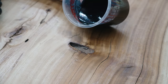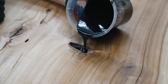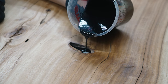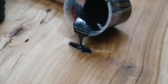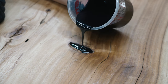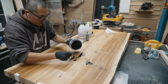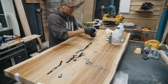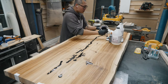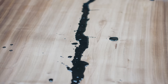The tabletop epoxy takes about 24 hours to dry and I ended up doing two pours because it shrinks a little bit when drying, so I didn't fill the voids entirely. It's always satisfying to see epoxy seeping down into the voids and slowly filling up, although I did make a mess. What I should have done is use caulk to make a dam so I can over-pour a little bit and prevent shrinkage — that way I could make only one pour.